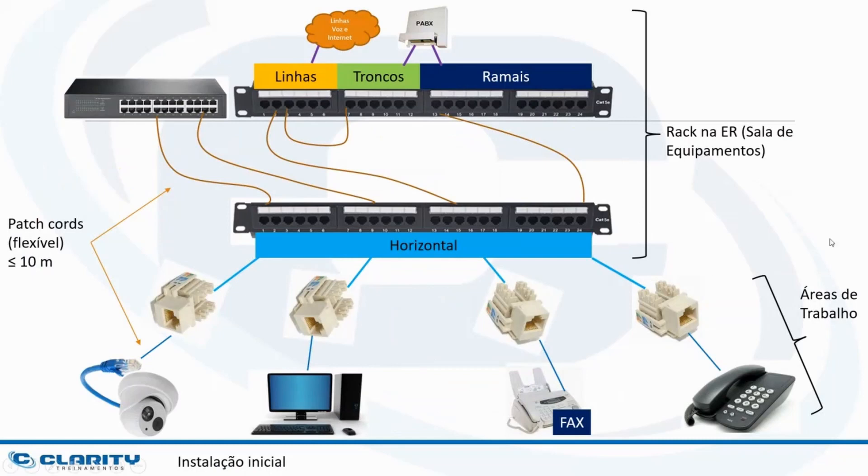How do I assemble all of this? Inside my equipment room I have a rack with the horizontal patch panel where all the cables arrive to serve my users, the equipment patch panel with the arrival of lines, trunks and PBX extensions, and my data switch. To set up the connection for a phone, fax, computer, and CCTV camera — all of them will be interconnected with patch cords with the outlets at the end of the horizontal cable. At the other end, I will use patch cords to connect each one to its equipment. For the phone line, I put a patch cord connecting the trunk input of my PBX. If I have two, three, or four lines coming to the trunks, I will have two, three, or four patch cords to redirect the entry line to the PBX entry trunk.